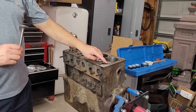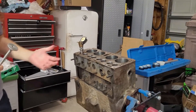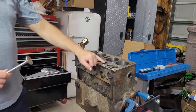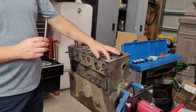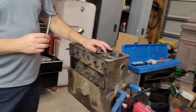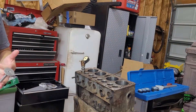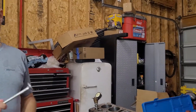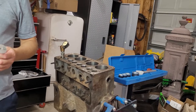We want to make sure that we don't have any runout — sometimes they call it runout, I call it concentricity. If the valve seat is perfectly centered with the center point of the valve stem, and the valve guide is perfectly centered with the diameter of the valve seat, then we get really good heat transfer on the exhaust valves, really good sealing through the life of the engine, and much longer lasting valves. So it's very important to have valve seat concentricity within an acceptable range.